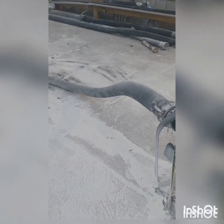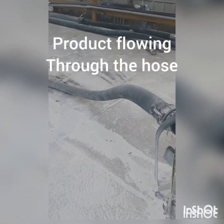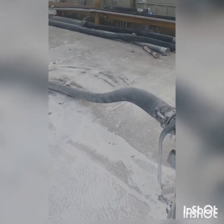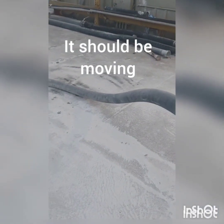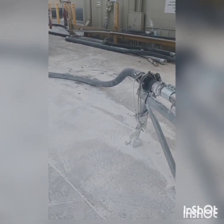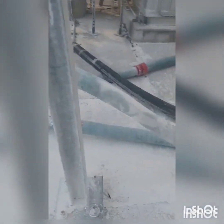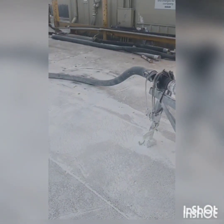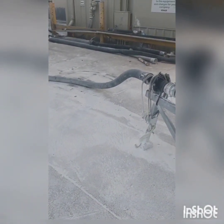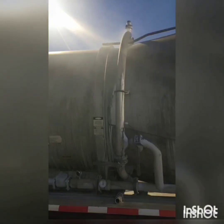A stop-up usually happens somewhere between the rear of the truck and the silo. If the product is flowing good, you can see these hoses are jumping. This is the product hose behind the tank — product's flowing through it, that's the normal unload. A lot of times when I'm unloading, I'm watching my gauges, but I keep a lot of eyes on those hoses. The way they're jumping and moving tells me a lot. Whether it's unloading in clumps or smooth — that's a smooth unload there, around 13 to 14 PSI. Just a good steady flow through the hoses.